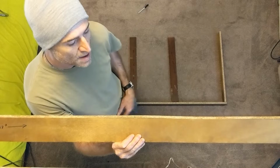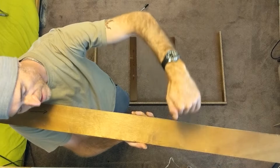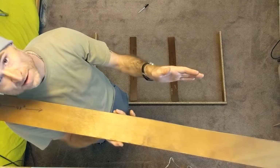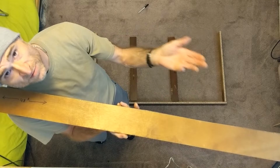It's the exact same process. The only thing that changes is the width of your pieces and the amount of rigid fiberglass that you put in it. When you're buying the wood, you want to decide what thicknesses you're going to want for the panel placement around the room and cut all those varying thicknesses at the same time. So when you assemble them, you just end up with the same panel but varying degrees of thickness on the panel and varying degrees of rigid fiberglass depth inside the panel. But for general purpose, the 3.5 inch width is great.